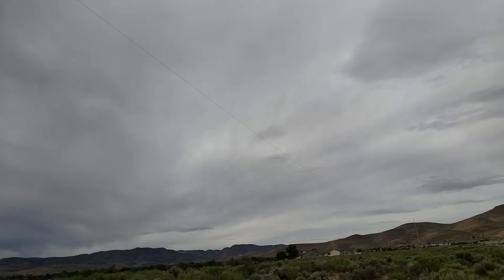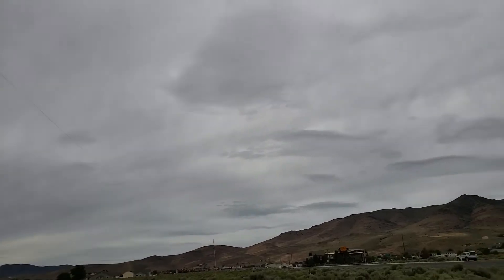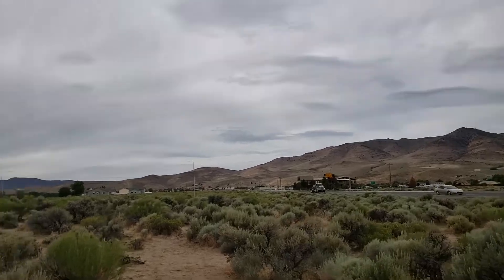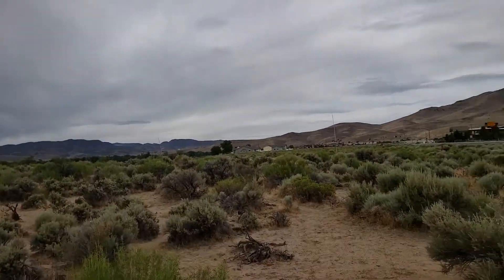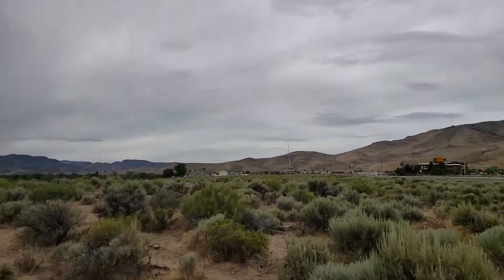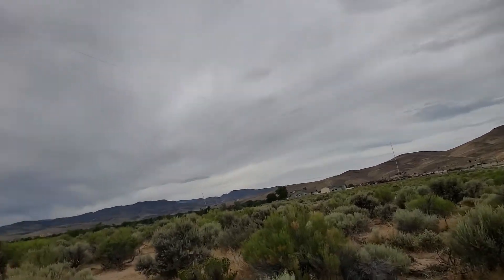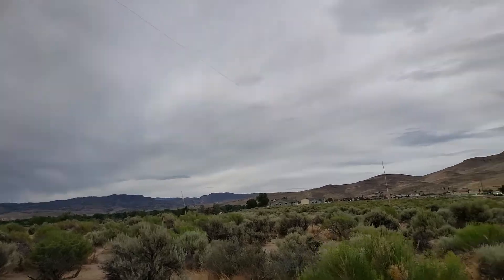It's big enough for a loop, so I'm tuning it. I pulled some wire off and I'm walking it. I'm using flagpoles from Walmart — they're working out okay so far. The loop started off at 1,122 feet. I found it was too long. It's aluminum wire, so I didn't take the velocity factor into effect.